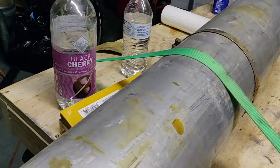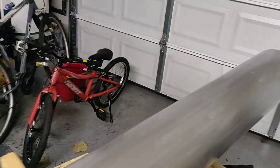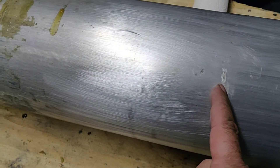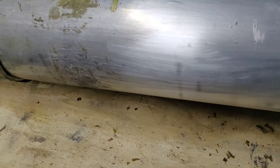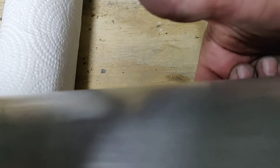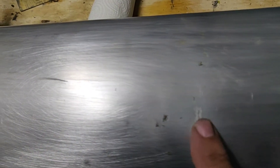Those were where the ribs were. As I turn it over, they seem to be the only spots, because this right here would have been the tip, and this back here would be the root. Here's another one, and here's some more scratches. I'm not sure how or why these things got there, but if I follow my fingers along one of the bigger scratches on the bottom and follow it up and around, it comes right here — so there was definitely some ribs wobbling around marking up these spars.